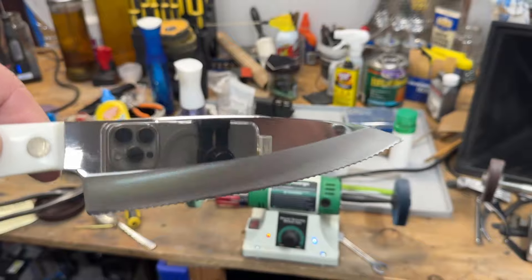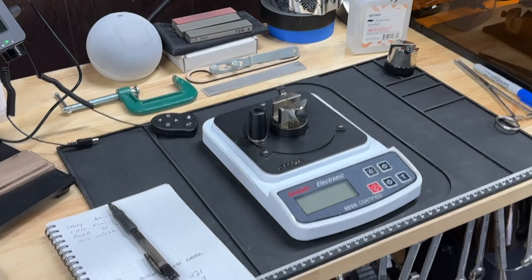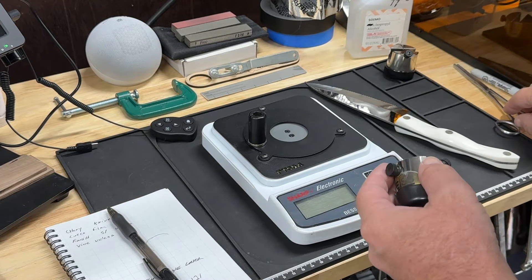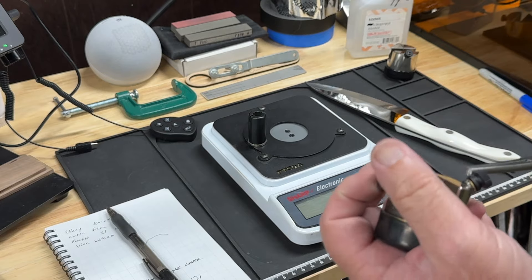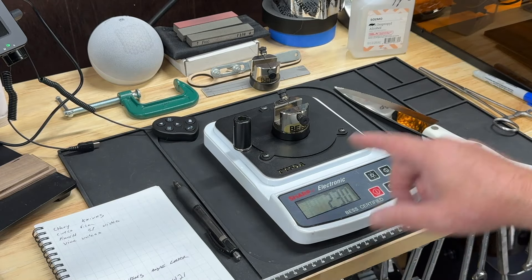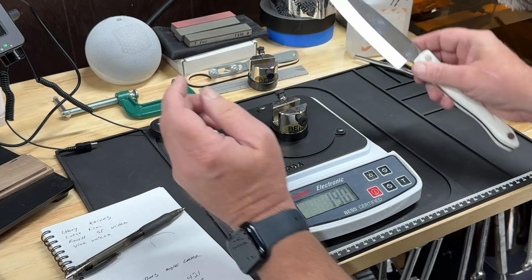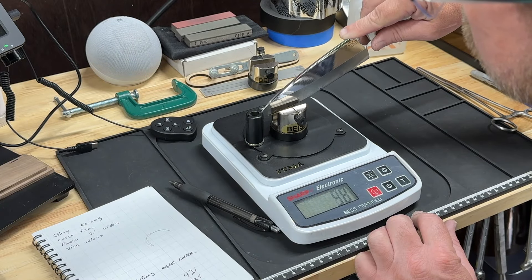A nice finishing touch is just hitting it on the one micron dental abrasive — makes it look brand new again. Let's see what a two-belt process gets us. You can see I'm only up to two minutes right now, so it wouldn't take much longer at all to do two belts with just one stropping pass: 230 on the last one, 190.